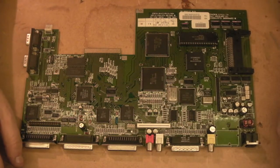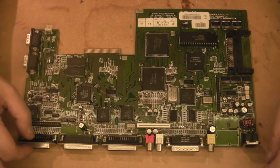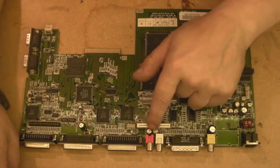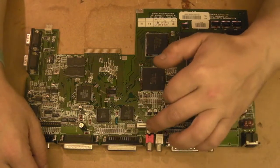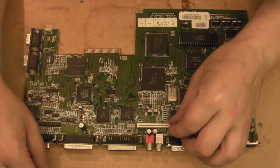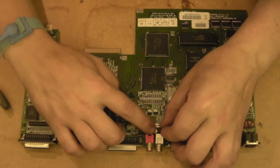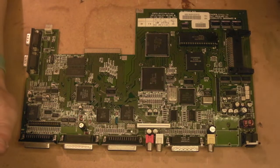And this is going to be the fun part, because I said there is a really dirty way of doing this. I've seen it done on countless Amigas that I've looked in and done little bits on in the past, and that is to basically rock those 2 capacitors until they break away, and then clean up the pads. You can get in there with a bit of braid and your soldering iron without touching that. And once you've got them cleaned up, take, what's the value on these? 22 uF through hole capacitors, and bend the legs so they're quite short, and then just bend a little 90 degree on each end. Basically solder them into place and then just push them down flat, and yes, it will work. If you haven't got the desoldering equipment I've got, it probably would be the best way of approaching it, to be fair, unless you can actually get someone that's got the equipment to do the proper job for you.